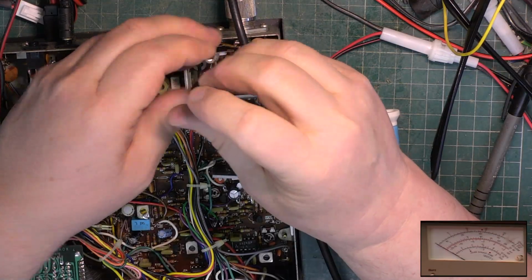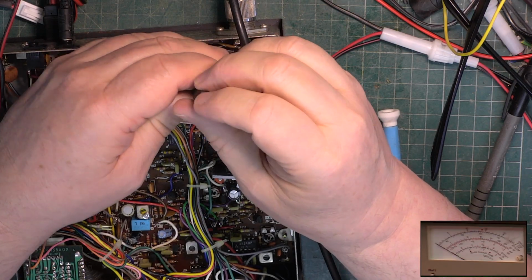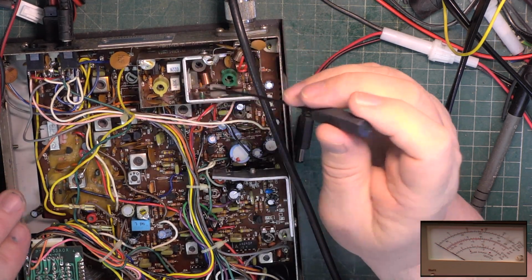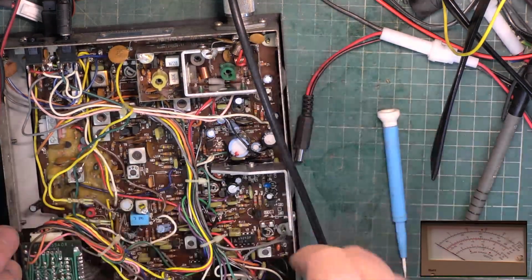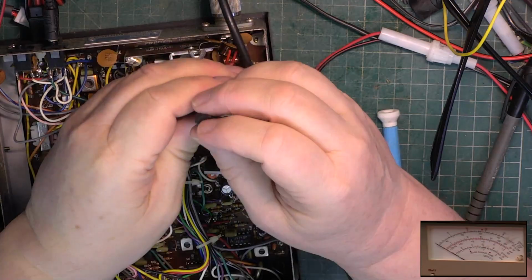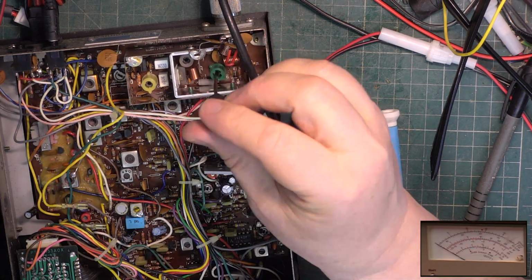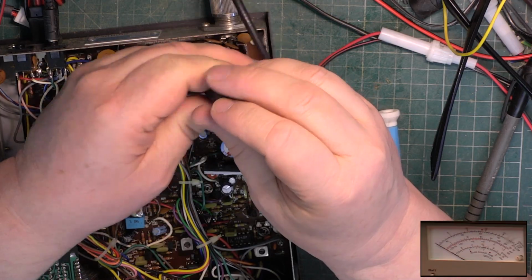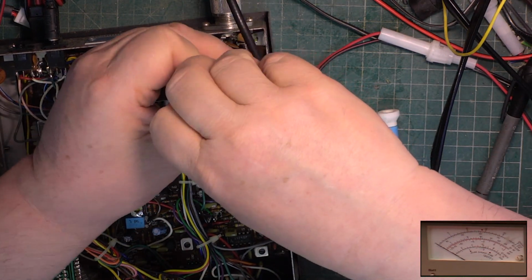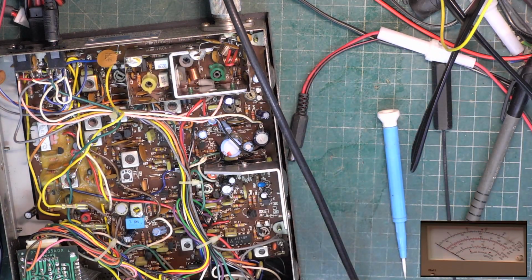That feels broken, so I'll just see whether I can move it. No. So we've got a problem, and that's, where's that? Is it missing? No, it's right at the bottom. God, I bet this knocks some interference out. That might have been the compromise to get it to transmit with the faulty one in the middle. I'll just move that kind of flush to the top. So we're going to have to unsolder this coil and replace it or replace the core.